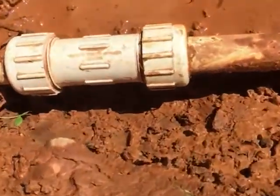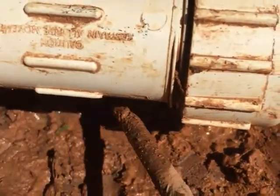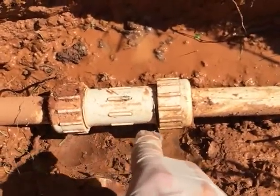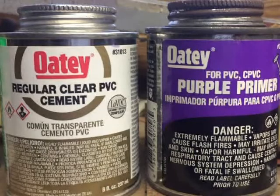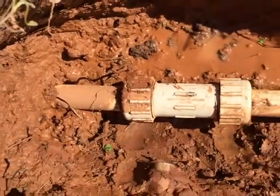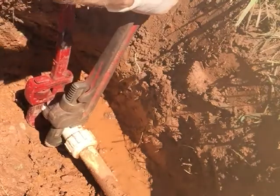I had to clean up and dig around the coupling and the pipe as well. I could not dig on the top — there's a brick or rock there — and I was hoping to make the repair without having to remove it. The best way to repair this would be to remove the old compression coupling, measure and cut a new piece of PVC pipe, and use slip couplings to cement the new piece in place. Here's a look at the primer and cement — just cement each end to the existing pipe. I decided to go ahead and fix the compression coupling, so I've got a couple of pipe wrenches in place, hoping this repair will last another 15 years.